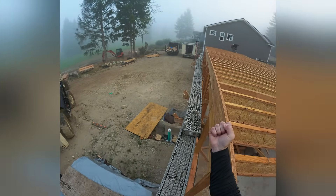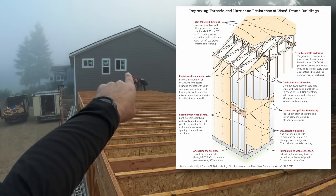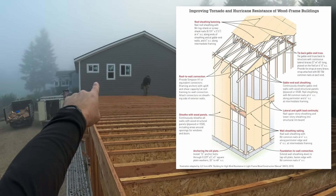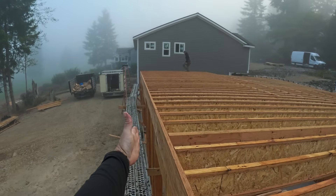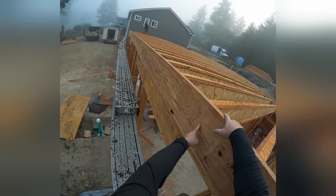It's a limitation, but not a big one — not a big deal at least. So here's how that works. Over there is a hand-cut roof, so from the halfway point that exterior wall is carrying half of the roof load, and that gravity load is then transferred all the way down to the foundation.